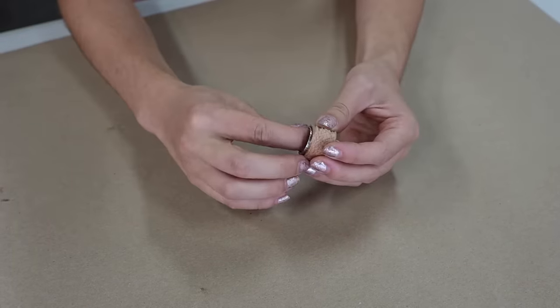It just applies an even amount of pressure on each side as you hand crank it, and it's got descending sized divots, and you just work your way down until you reach your final size, which for me was this size. And I think this is a really cool clip because you can actually see the wire relax as it gets annealed. So that's that sort of like softening and recrystallization.